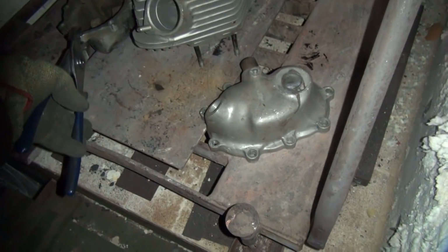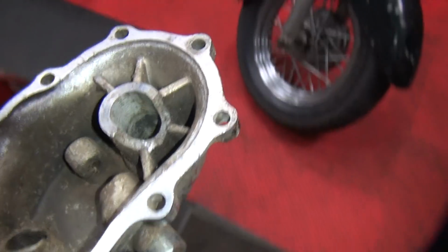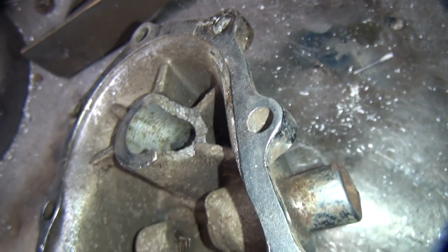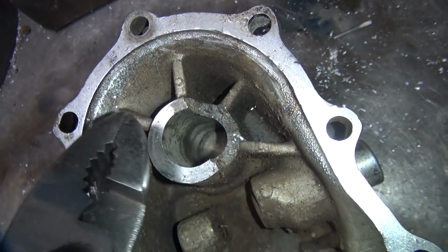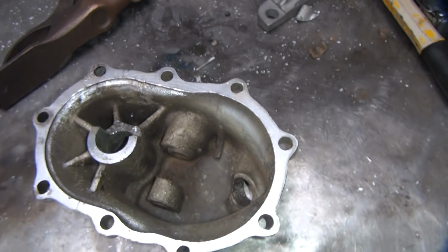Oh, drop it. Right. Back in there. I'm going to try to do this one, see if we can get this one to weld. The last one didn't weld. Looks like there's a crack opening up right through there too. Right there. There's a crack, it looks like. Yep. So it goes down there about a ½ inch into it. Alright, so we'll go ahead and V all that out a little bit. Crack is right here, I think. Right through there. If in doubt, cut it out.